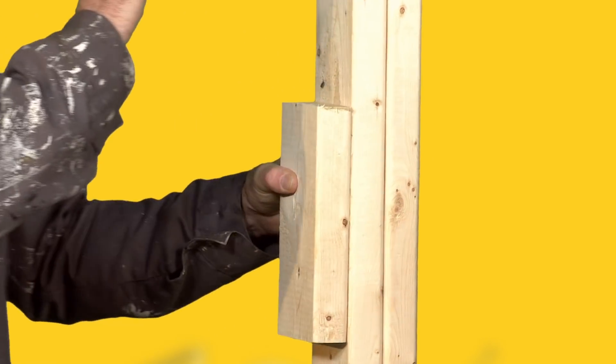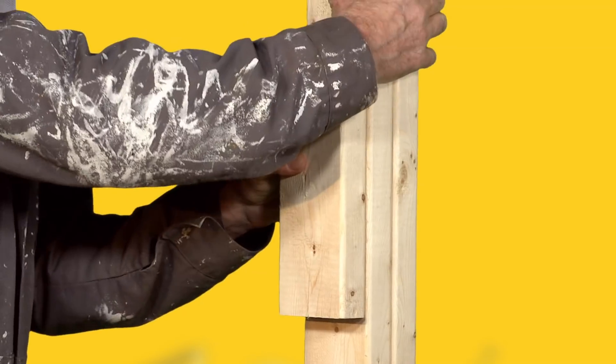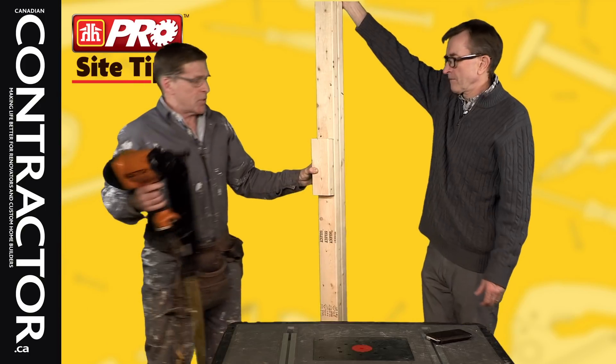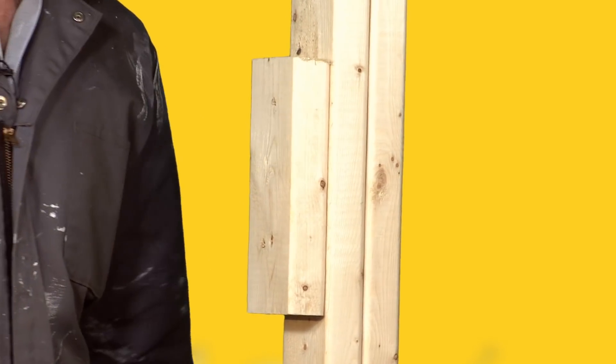So you've got your doorway here, you've got your framing for your doorway. Just to make sure the electrician never puts a box on the double stud, you need triples there so the molding doesn't get cut. Make sure he's got it at the right height and fires them into the stud. Guaranteed those boxes are going to be in the right spot.